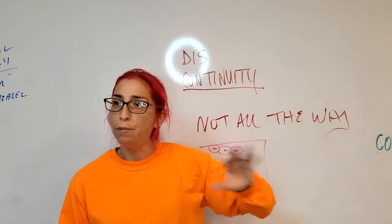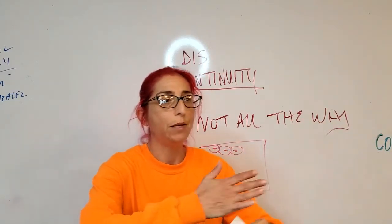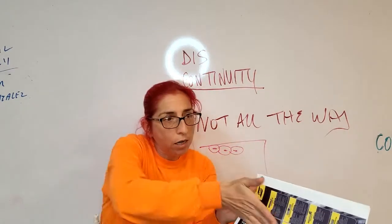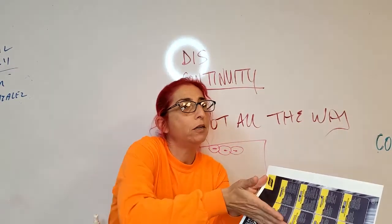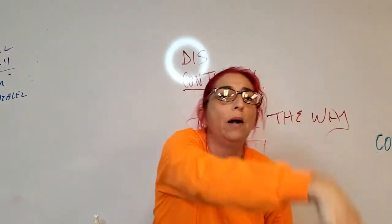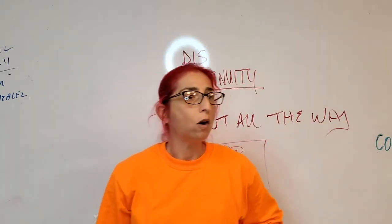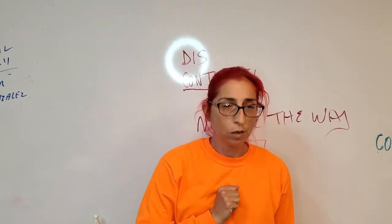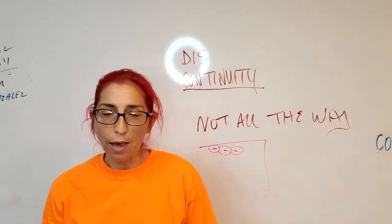Now if I have overlap in the wrong places, I'm going to overlap that piece of slag, right? Or if my weld is too convex and I can't get in there because it's made that little teeny tiny sliver. Or the other one is the old timer says, hey, don't worry about it, slag will burn out. If you're doing x-ray quality welds, and you actually want to take out all your slag, it's important.